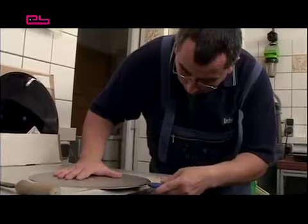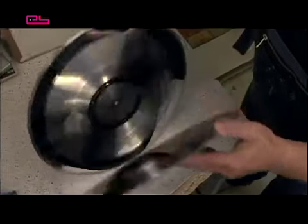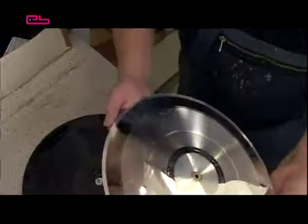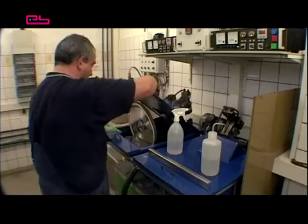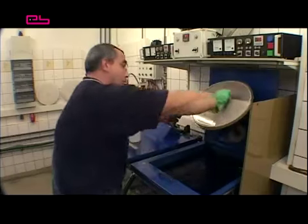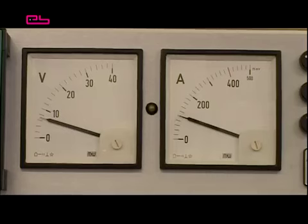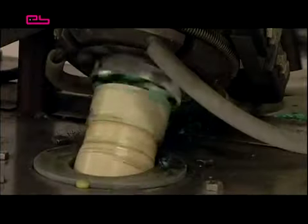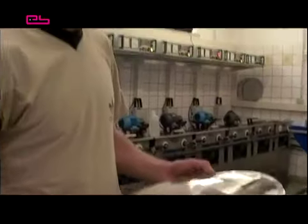When electroplating is finished, the newly developed nickel plate is separated from the foil and is now called the negative. Since no further replicas can be made from the foil, another step is necessary. The complete electroplating process is repeated with the negative. At the end of this process, the positive is developed, the so-called mother. From this mother, several negative copies are produced, which are also called sons or stampers and are used as pressing templates. One template is good for manufacturing approximately 1,000 discs. With this, the electroplating process comes to an end and the first negative is prepared as a mould.